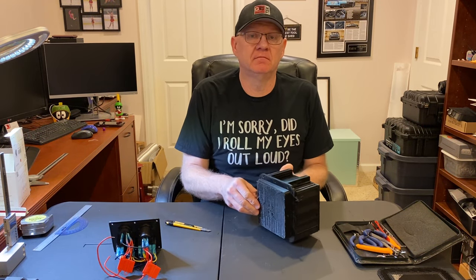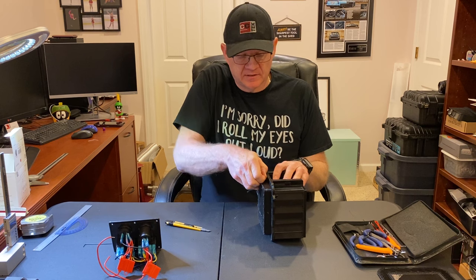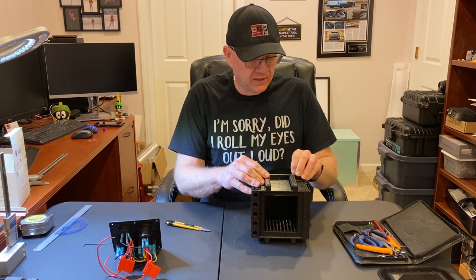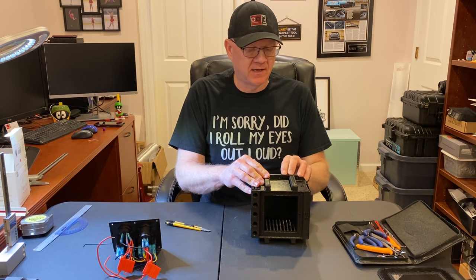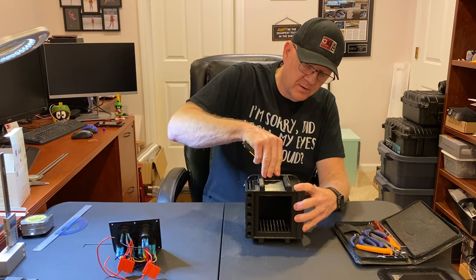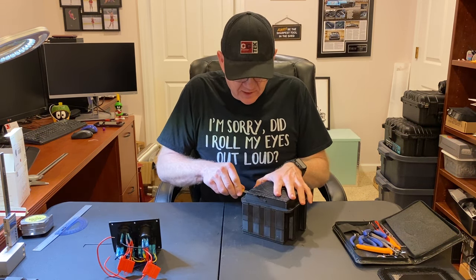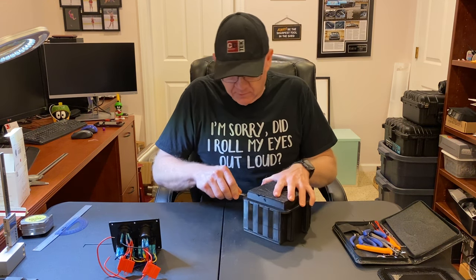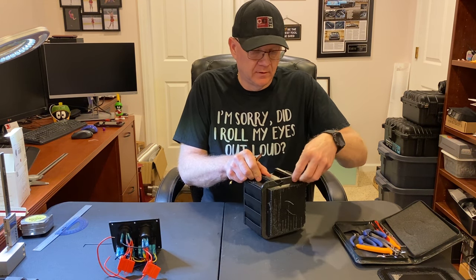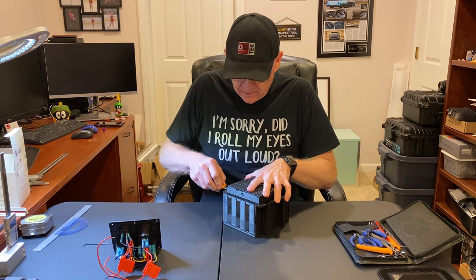Now, I have fairly thick sections, 200 thousandths of an inch or so, on some of these surfaces. When you're doing this weeding or peeling, and if you have a lot of fine detail in your parts and you have thin sections, then you're going to want to be obviously very careful doing this, because you can damage your finished part, stuff that you didn't intend to peel away.